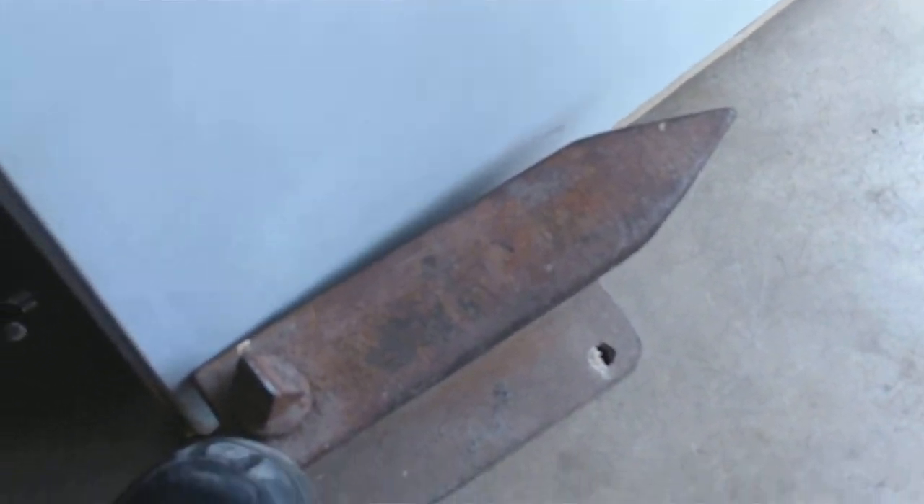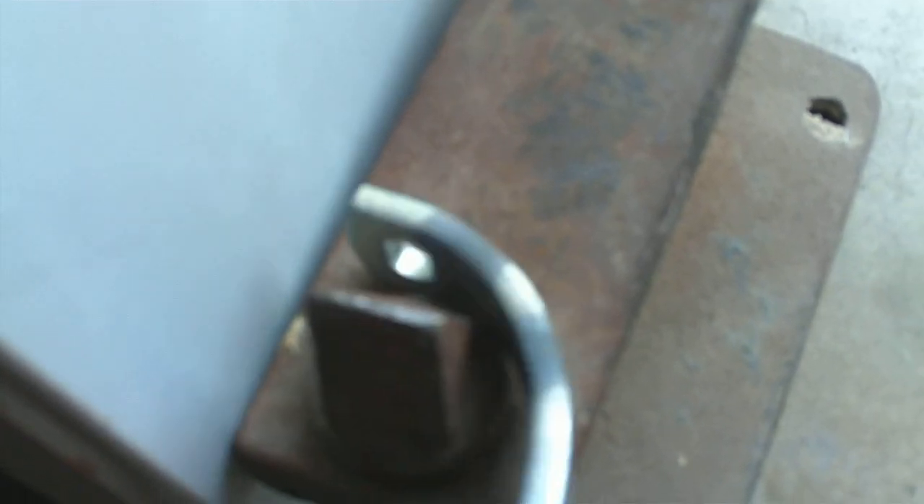This tube — I had to heat it up and bend it. You can see the pretty serious radius there. Some people have a kiln with a lot of high heat and they blacksmith it, and that's all cool. I don't have a kiln, but what I do have is a little inexpensive propane tank — a couple little ones you use at campfires. I just heat it up and then I have an anvil with a pointy end. You just set your workpiece right over the anvil and hammer away when it's heated up. That's what I did — I hammered away and bent it to the shape I needed.